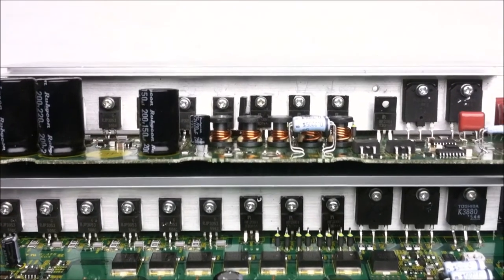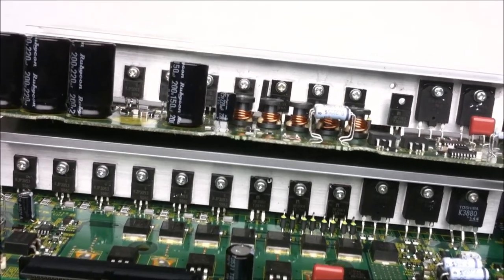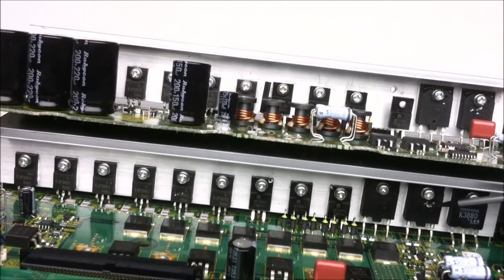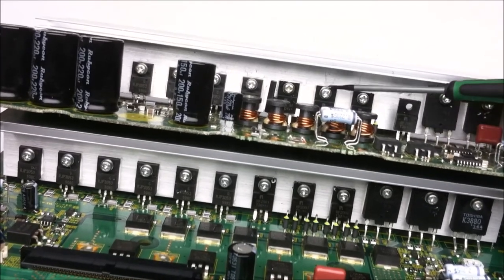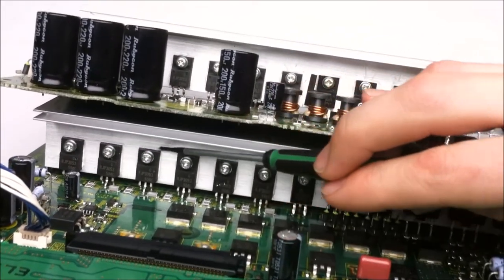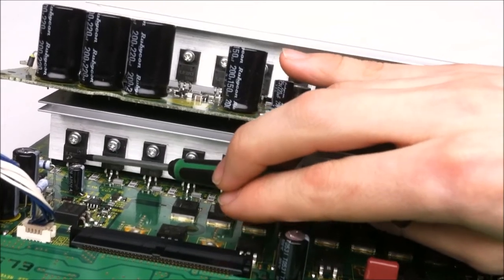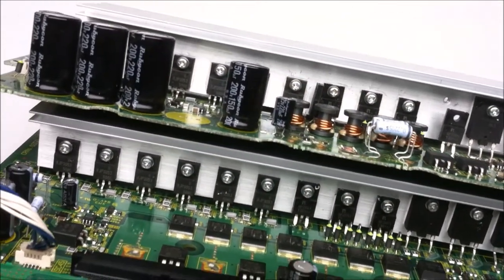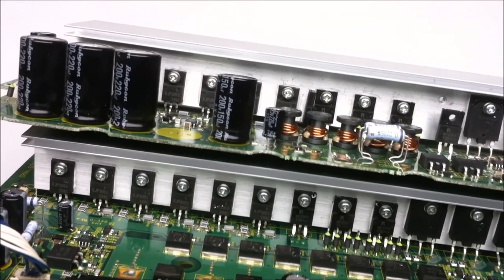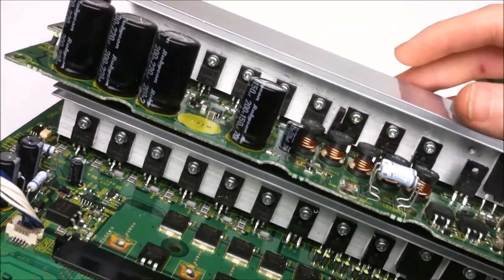Let's go over the X and the Y sustain boards a little bit more in detail. These boards share some identical components with one another. So first thing to note, these two large power MOSFETs here, and on this board here, and then three diodes. So same three diodes here. There are six transistors on each board, and five of those transistors are controlled by another transistor. And I think they use transistors in this case because they're a little bit more precise and a little quicker to respond, and probably have a lot to do with the screen PWM brightness. Not quite sure, not a plasma TV technician.